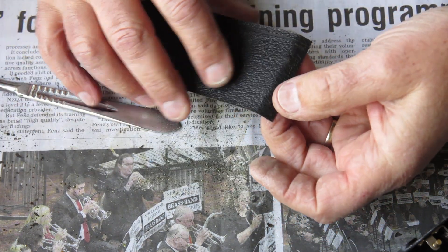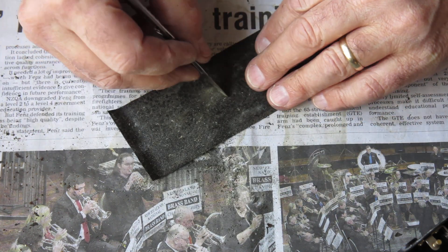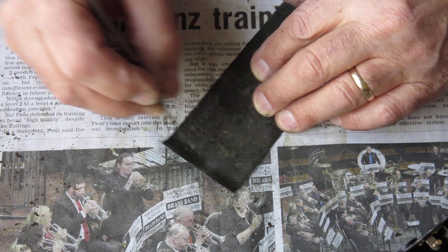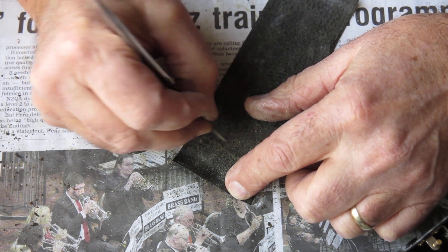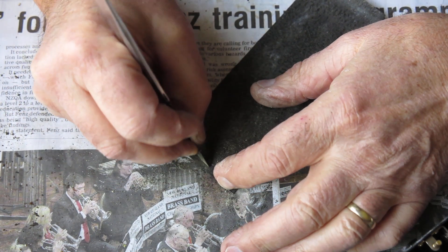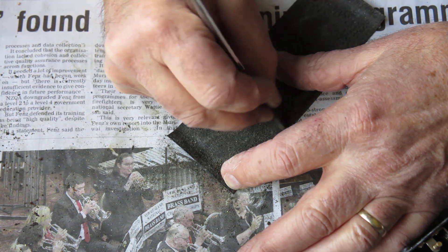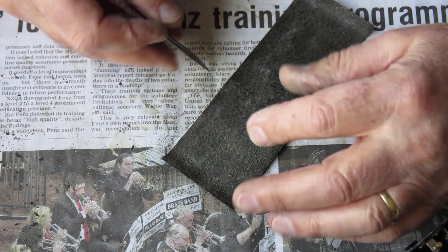I was being a bit clumsy — I just hit that and the leatherette's cracked at that point, so I've got to be extra careful. Cracks on edges are not much fun to deal with because it's hard to get the leatherette to fold neatly round the corner. If it's got a crack right on an edge where it doesn't want to fold, it just tends to open up the crack. However, we'll deal with that when we get to it.